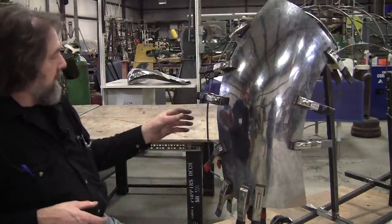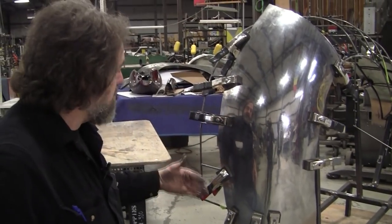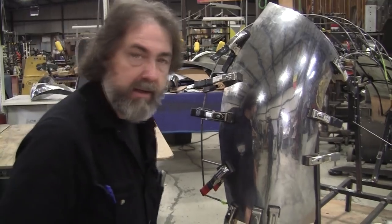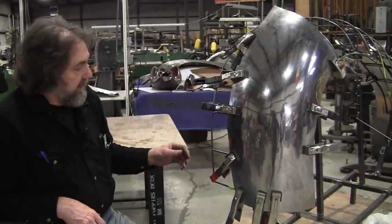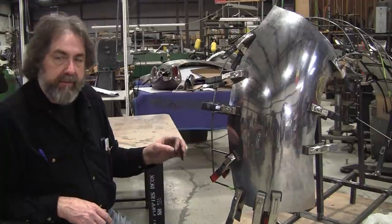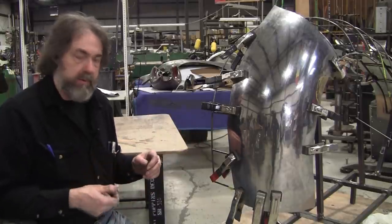So I thought about this rear panel that's going to get welded on, and that has no shape in it. It's just barely basically arranged. It's more of a flat panel. So what we'll do on that is we'll do a little welding demonstration. And this is 20 gauge. And 20 gauge is 35 thousandths of an inch thick. And it can be a little intimidating for a beginner to weld it, because they blow holes through it.